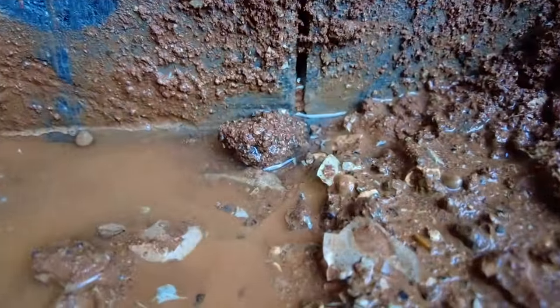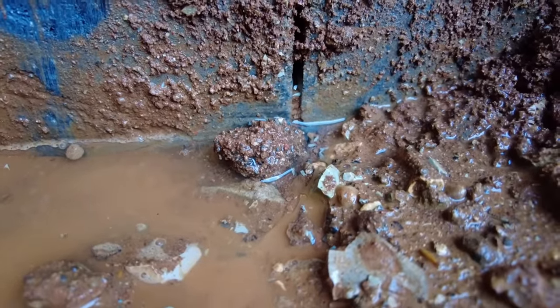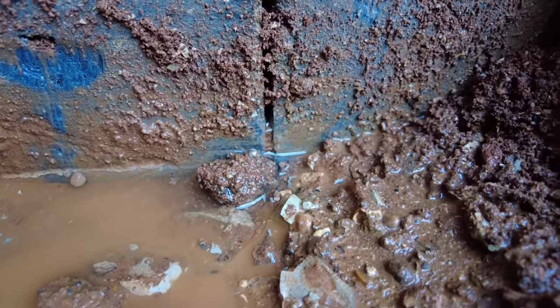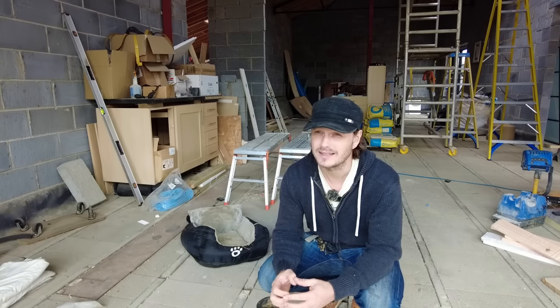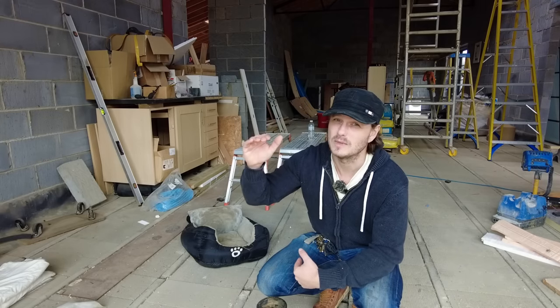I'll show you a clip of the water actually coming out of the building — you can see that's running water. The bricklayers hadn't jointed all of the foundation blocks properly so everything just ran through from the other side of the building. I did a load of research on the problem, and the reason I used the tanking product that I did is because it was tested to resist hydrostatic pressure up to three meters, and I only had to tank up to 1.2 meters.